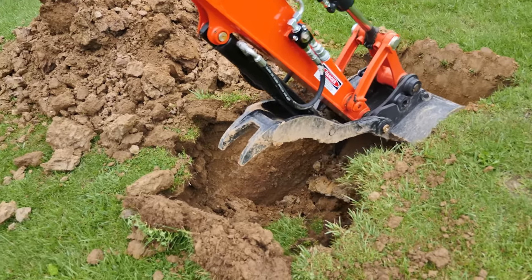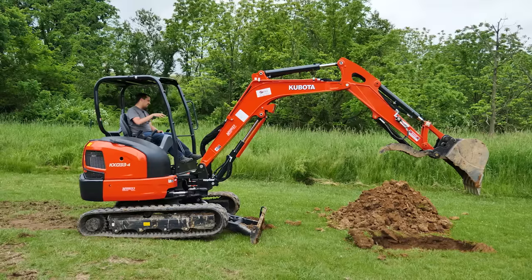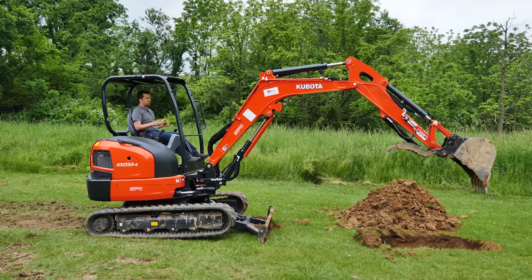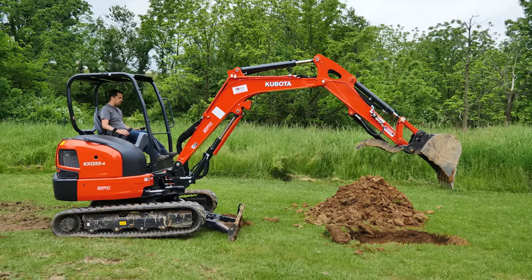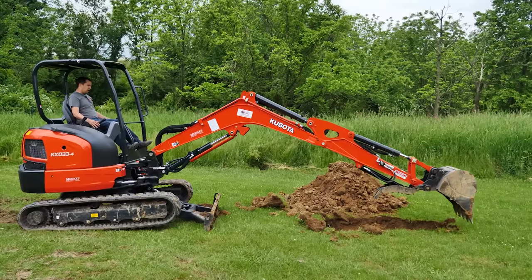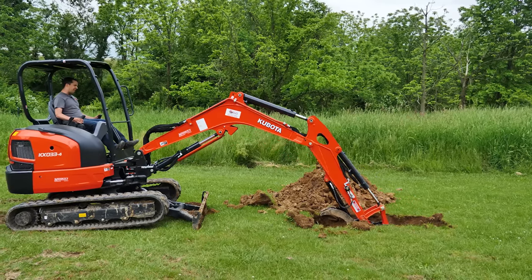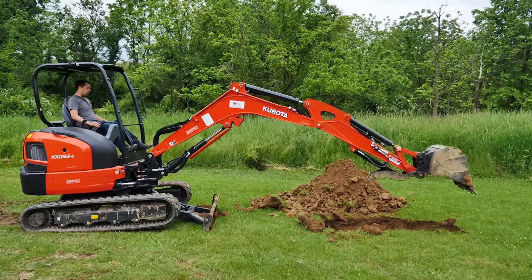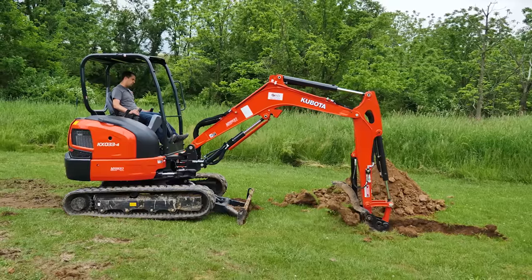What I've done so far here is basically just a curved trench — a curved hole in the ground. Excavators are typically specced out in what's called a two-foot flat bottom. So this is basically about a 10-foot machine, and that 10 feet would require you to dig a 10-foot flat trench — you have to be repositioning every two feet. You always want to be watching when you're speccing a machine out that if you're digging at those deep depths, you have more boom than what you need, otherwise you're just repositioning over and over again. In order to dig a flat trench, you need to be using multiple functions at the same time. When you go in to do your dig, you want to take your bucket and curl that bucket back in order to break up the soil. But about the time that the bucket's bottom starts to go flat, you want to also start to pull the dipper back into the machine so that the bottom side of that bucket starts to cut a flat trench. It's that combination of the bucket curl and the dipper coming back into the machine that helps you dig that flat bottom — to drop your pipe into, your electrical line, your conduit, or whatever you're laying out.